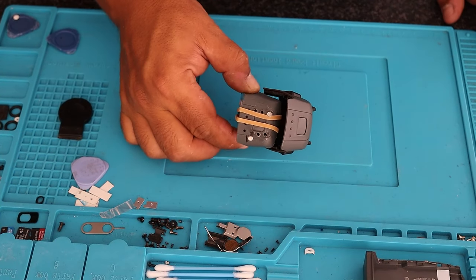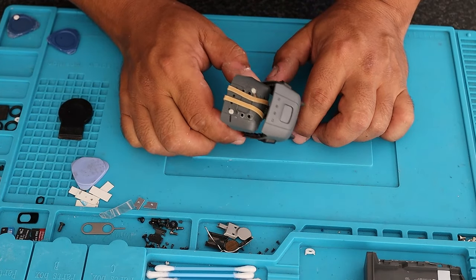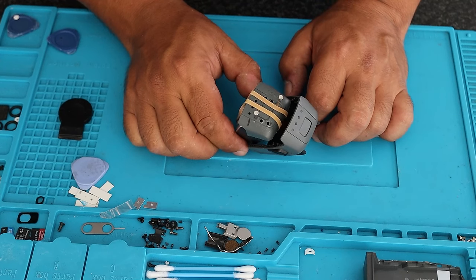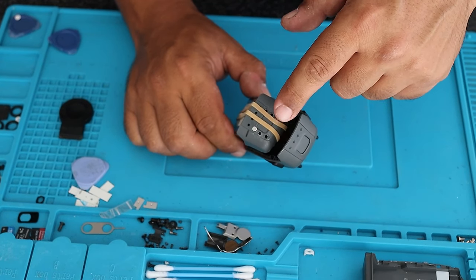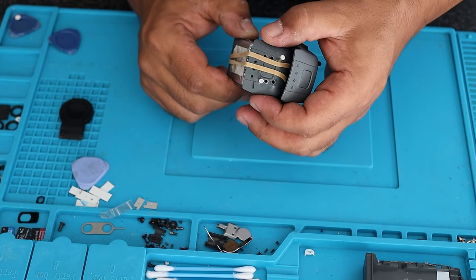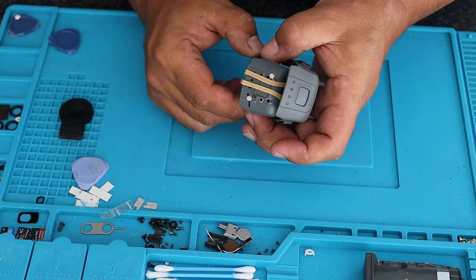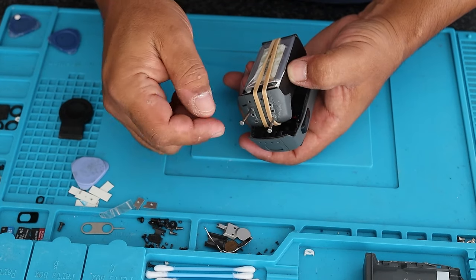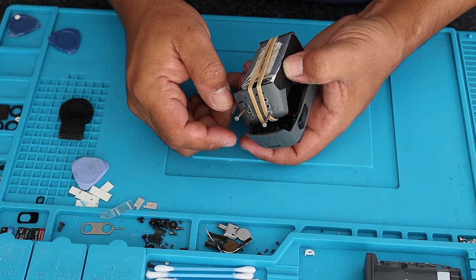That is my custom little jig — it allows me to charge all three cells simultaneously with my power supply at the correct voltage, and again low, low, low current, to see if the cells can be woken up again without swelling or damage. It's literally two nails epoxied into place, two elastic bands, and an old Spark battery cover cut out to accommodate fitting it on securely. Negative and positive clamps from the power supply, and I give it some voltage at low current.